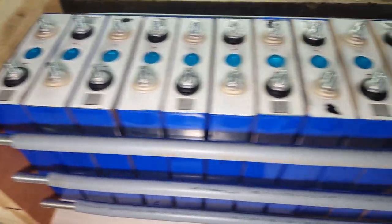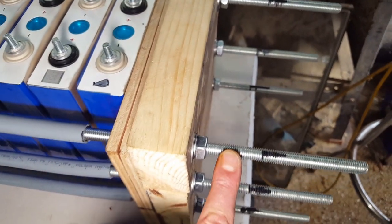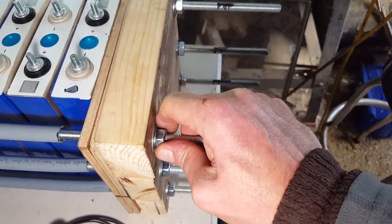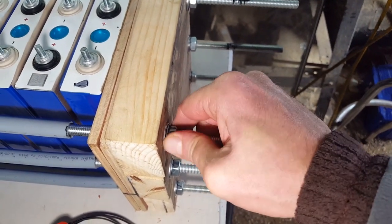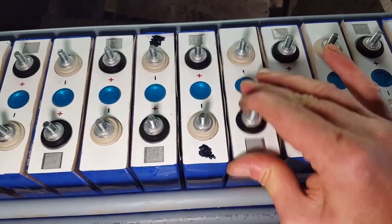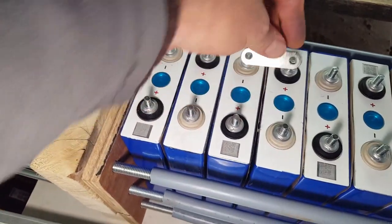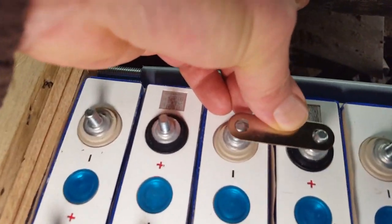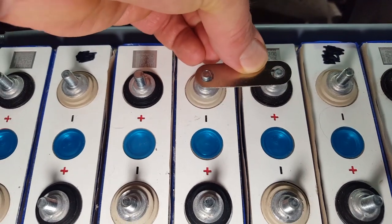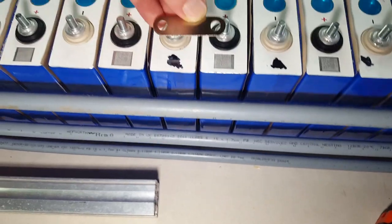We're making progress — squeezing up nicely. I've wound them in about two inches now, and it's only just getting to ouchy finger tight. I haven't started to use a spanner yet, it's still finger tight. Nothing's popped yet on the burst caps, I can still wiggle them, so they're not squeezed to death. I'm just starting to be able to get the bus bar on most of them.